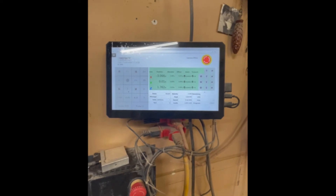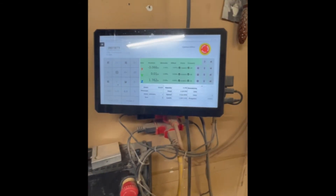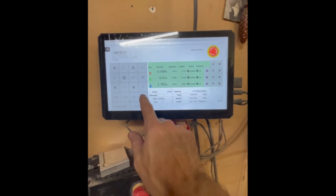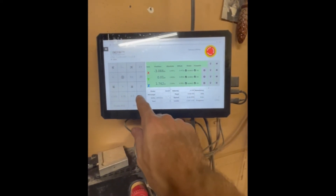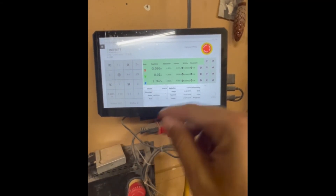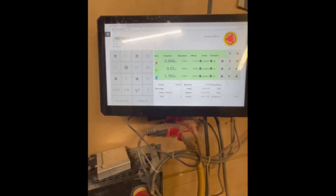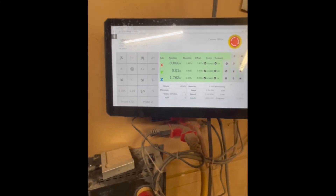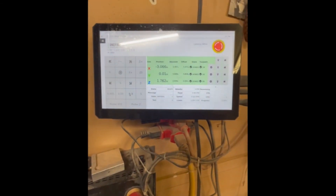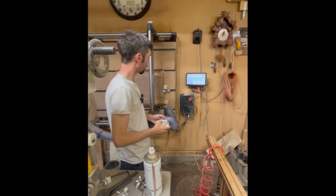Just to give you a closer view: the Y direction is the left and right as the machine is mounted on the wall here. You can select step increments right here — five will be five inches since we're in imperial, half inch, 0.005 of an inch. Our bit is a one-inch bit. We'll move it with the controller as it cuts, and then to shift over for each pass we'll do Y plus 0.5, doing that twice — moving it over an inch each time. Now I'll lower my Z axis a little more.